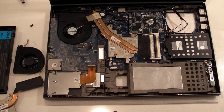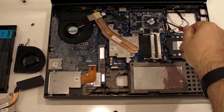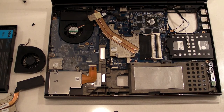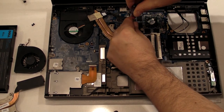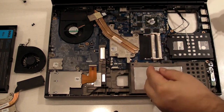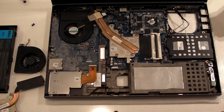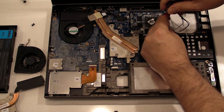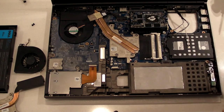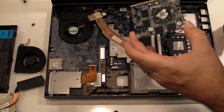Well, here we are. The laptop has been disassembled, and here's the GPU daughter card right here. Removing the daughter card is really straightforward. There's only two screws to hold it on. They're sort of these posty type screws. Best not to lose them within the guts of the machine. Once those screws are taken out, the card rises, and there we are.